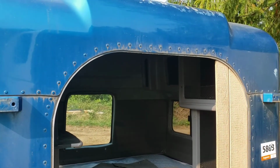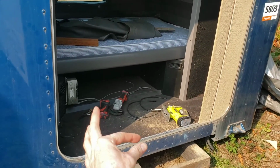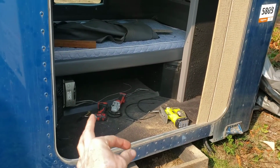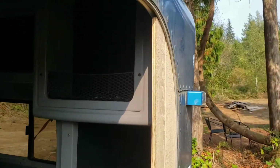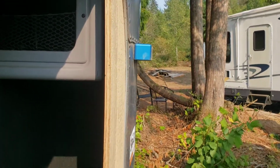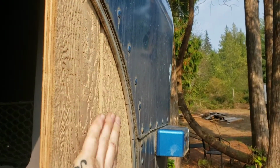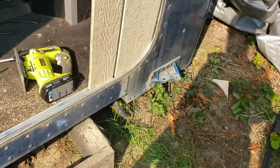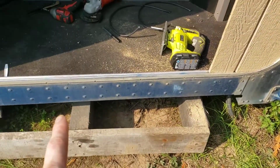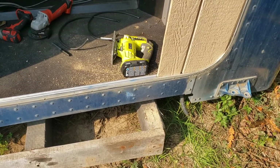But I've gone over a few renditions of how I was going to do this. I felt that was the width of a 2x2 or a 2x4 right there. But then I got to looking at how this little thing was. It's got this little ridge in here, and I felt like if I could get my siding into that, then any rain that comes over is gonna come onto this all the way down. And even though it's gonna go into that, it's already got drain holes down there, right? So I mean, yeah, where can you go wrong?